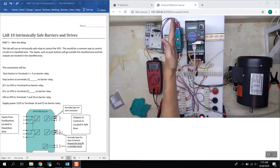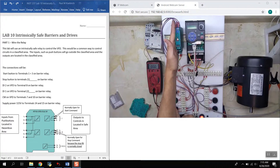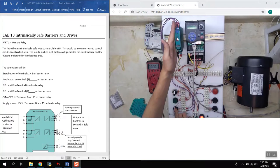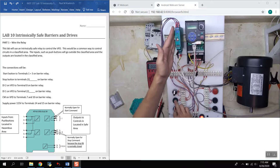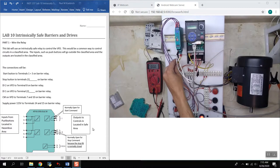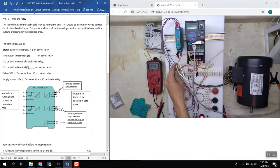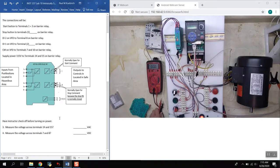When my finger is not on the push button and it's normally closed, the light will be on. That signal will drop out whenever I push the stop push button. The reverse is true for the start push button — it only comes on when my finger is on it, providing a momentary contact to tell the drive to start. This is how it gets wired up. This relay gets powered from terminals 14 and 15 — it's a 115-volt relay.